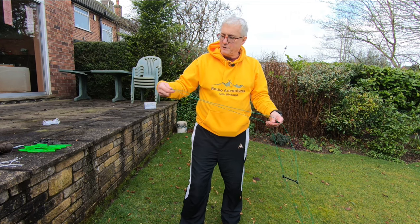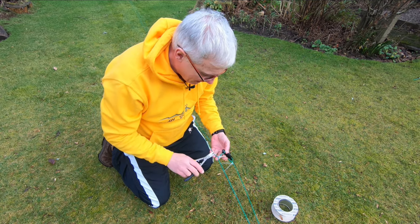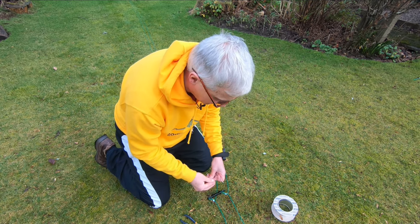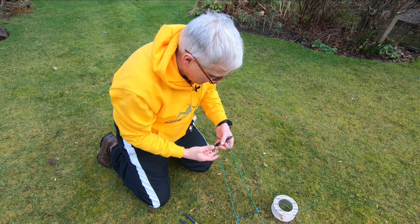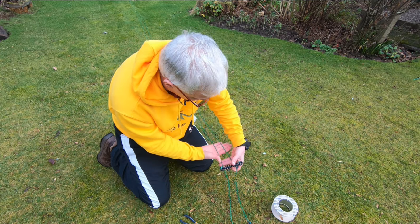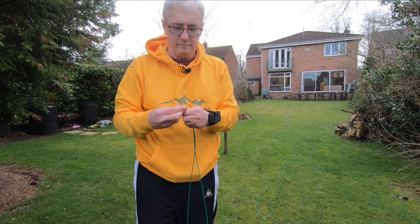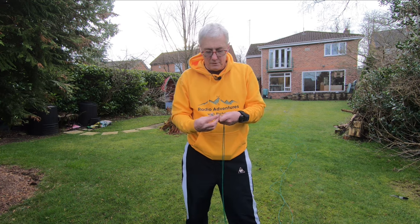We've now finished the feeder, and these two ends will attach to the antenna tuning unit, which we'll feature in another video. Amazingly, our antenna is nearly ready — I'm just going to cut off the excess cable tie ends to make things look a bit neater. Now here's our open wire line feeder going back down the garden, and up the garden is the other part of the antenna. At the moment it's just in one big loop, so all I need to do is go along this part of the antenna to find the midpoint and cut there. That will form our two sections of the doublet.